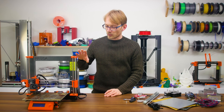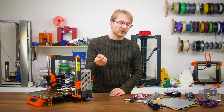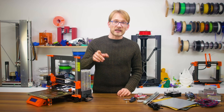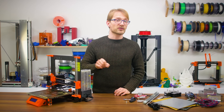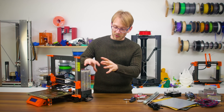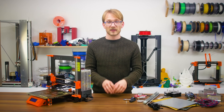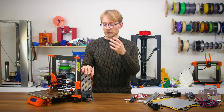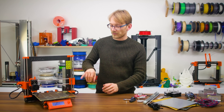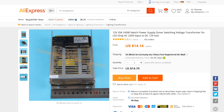The last big part for electronics is the power supply. The original Prusa uses a 12V 20A type, and while pretty much all of these parts could handle 24V and would probably run better with those 24V, 12V supplies are still cheaper and more easily available. I'd actually recommend checking resellers in your country first — they might actually be cheaper than ordering directly from far east sellers, since these power supplies are comparatively bulky and heavy, and sellers sending them from China or Hong Kong will have to pay quite a bit for shipping. Finding the exact supply used in the original Mark II is going to be hard, but it should work nonetheless and at about 15 dollars, it's practically the same price as the old one.